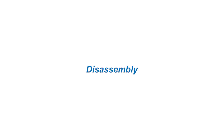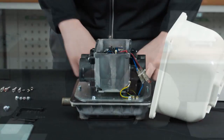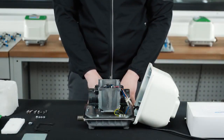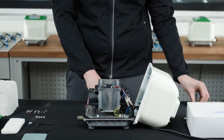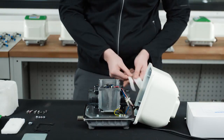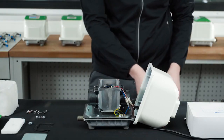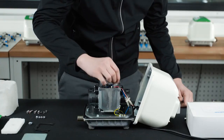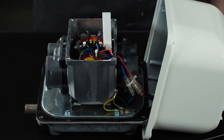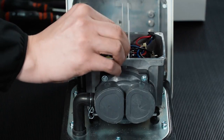Disassembly. To get to the diaphragms, we need to remove the valve boxes and take the diaphragms off the ends of the magnet, which actually moves them. Since the diaphragms of the smaller JDK series, up to JDK 80, center themselves, using spacers is not essential. We recommend using them anyway. You'll need four of them, two on each side. Please remove them only after reassembling the new parts.